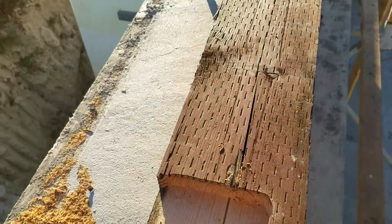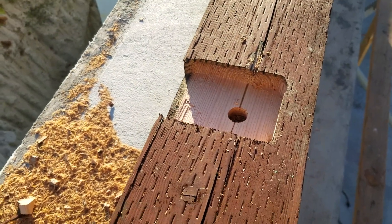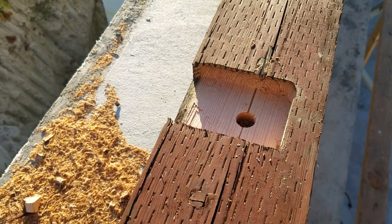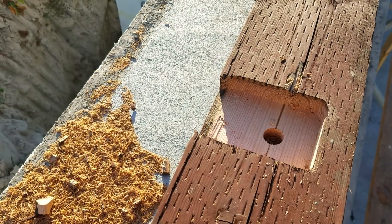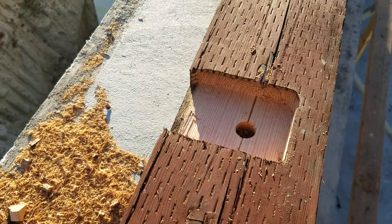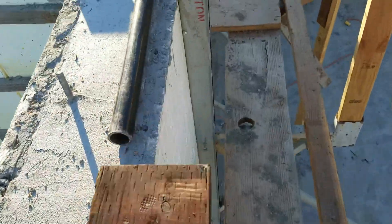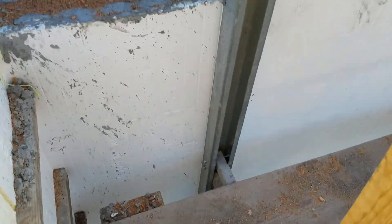This does seem to be a lot of work. The mud sills are specified as three by six, which means they're two and a half inches deep, but structurally they're only required to be one and a half inches thick. So structurally, it's meant to be routed down so that the plate washers and bolts will fit.